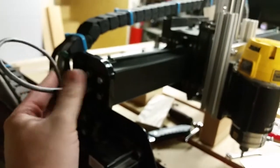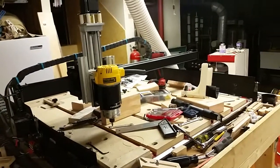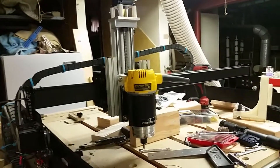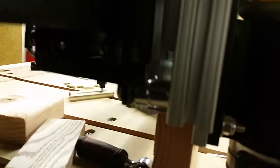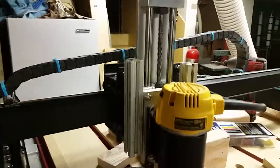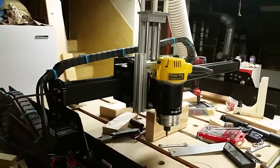I had to use a longer Y2 wire because of the lift, and I've bundled up some of the wiring. I've seen other people put their linear rails where part is hanging down — but then the lowest part of that carriage becomes your max clearance, so you want it as high up on the extrusion as possible. I got it within a quarter to a half inch of the top — that was just where the bolt holes lined up on the carriage. That way I can move the Z completely out of the way for bit changes.